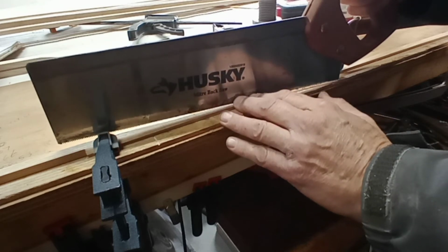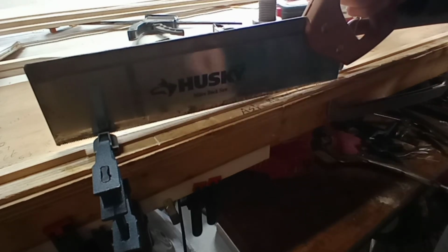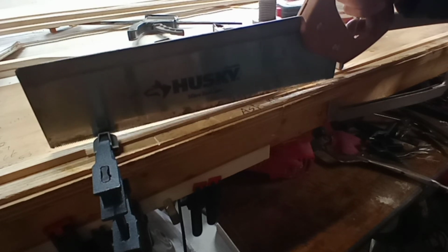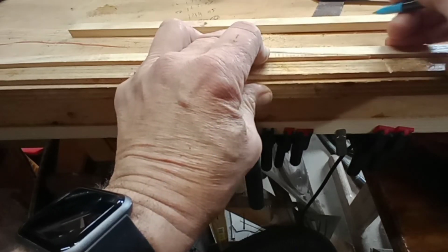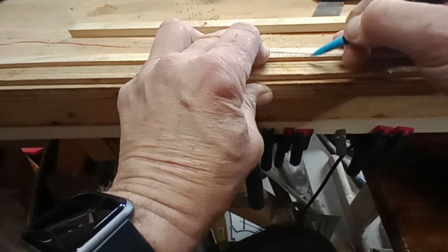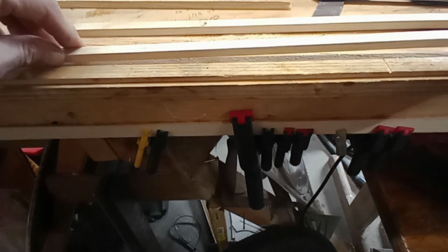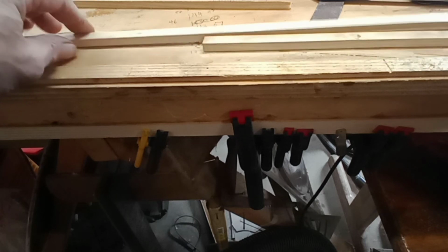All right, so I got it clamped down, and this here is a lot steeper angle than I normally do, but it's still shallower than the 15 to 1. And I can see why 15 to 1 would have been recommended, especially back in the military era, World War I and World War II. And, well, since we have to do multiple splices before we glue up, we're going to label these right across the splice. So we'll call this one 1A. And we need 49 more inches. So I'll vacuum this off. I'll line this up, and this here one will work just fine for the next splice.